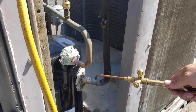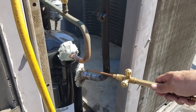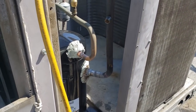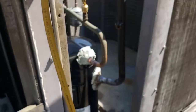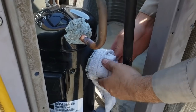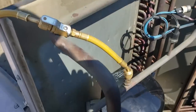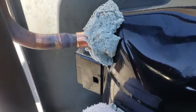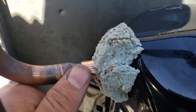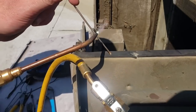You're really not supposed to cool welds, but on a sensitive product like your compressor I don't want the body getting too hot. So we're going to cool it and just let that sit. Now I want you to do the top of the head using the same principles — heating the copper first and then bringing it in. You just made your life a lot easier by bending that. Heat the copper first, the male part, getting it nice and hot, moving it around.